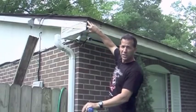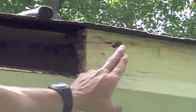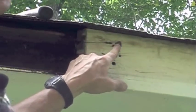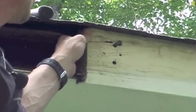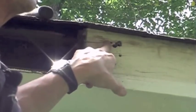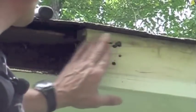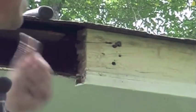This fascia here, we're going to pull this off. You can see it's rotted pretty bad. This is a perfect example of what not to do when repairing or putting up fascia. Never use giant common nails on here. You don't need to put 16 penny common nails on here that are going to split this redwood. This is redwood fascia and it splits really easily. All you need is an 8 or 10 penny galvanized finishing nail, and you can secure this really well without splitting the wood. Right here we have another problem with the seam not being on the rafter. If the seam is not on the rafter, then this can separate, which you can see by all the darkness back here. It already has done that, and that's why we had rot in here.